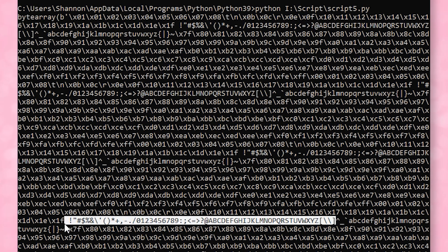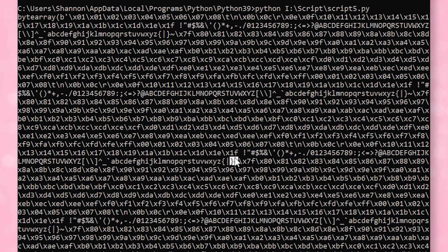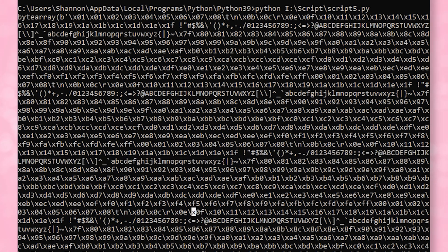Most of it is just going to be random data that I'm not going to dig into, but something seems a little bit out of place. I'm going to highlight this part — doesn't that look a little odd? To me, it looks like a password that was generated from a password manager like LastPass — one of those random generated passwords. Now if this was a consumer device using memory to pull up data like that, then that would prove the product was saving data in plain text. Because if that was a password, I would be able to read it with my human eyes — it wouldn't be encrypted in any way.